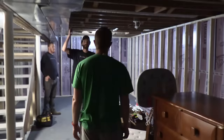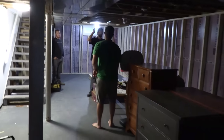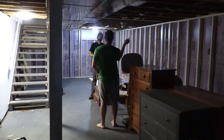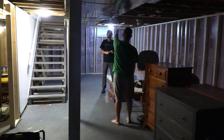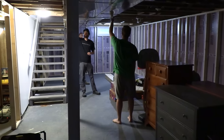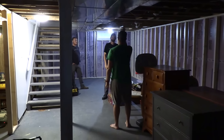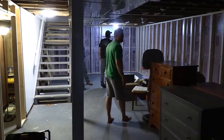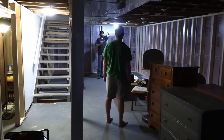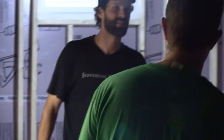On the can light spacing, do you want the edge of this duct — it's got three or four different edges — what do you want to be considered the edge wall to be balanced off of? What's your primary visual reference point? Probably this wall. So you almost want to count the near edge of the beam to be the wall and pretend like the duct's not there. I agree with that. I don't think they need to step out at all — two straight lines. We've got a couple of obstructions with the ducts that run through here. With recessed lights, when you hit obstructions, you just cheat to the position of the least of evils — move it as minimally as possible.